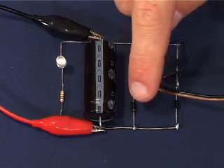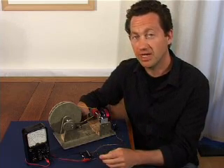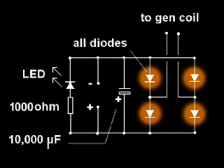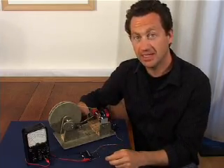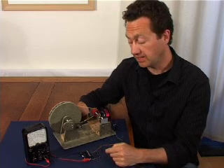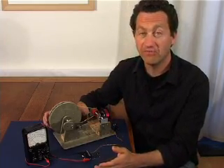The circuit uses diodes — it's called a bridge rectifier circuit. The arrow-type symbols are the four diodes, and they're wired up in such a way that when you put the AC into this bridge configuration of diodes, it converts the AC into DC. That's sent to a capacitor, and the capacitor smooths the voltage. There's also a resistor and a little LED on the circuit on the table here. That voltage then goes to whatever you want to power — be it the radio or the mobile phone.